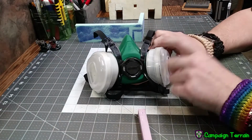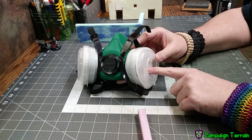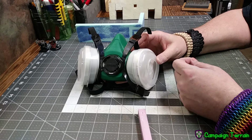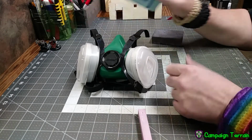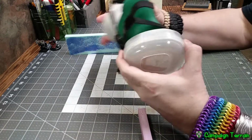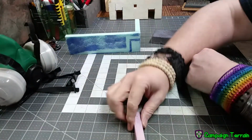First things first, you're definitely going to wear a breather. I definitely suggest one of these with the filters on the side, but at least one of the little paper ones that fits over your mouth and nose. Make sure it's as tight and snug as possible. Tape it down if you need to, or get one of these with the filter. Anytime you're sanding anything like this, you end up with all this little dust, and it gets into the air, and if it's in the air, it gets into your lungs. So you definitely want to wear a breather. Not a question, put it on.